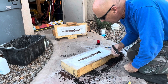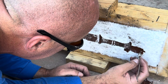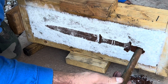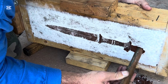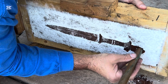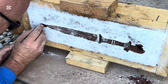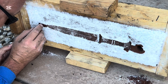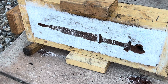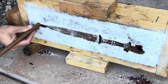Now that I had an impression of the dagger in the sand, I had to figure out how to get the metal in there. I carved channels in the sand and then drilled holes through the top of the frame so I could have a channel in which to pour the metal. I used a copper pipe to press a hole through the top of the mold and then extracted it. At the tip of the dagger, I carved a little channel so that gases and excess metal could vent out the other end as I poured the metal. I used a smaller copper pipe to bore a hole for the vent.